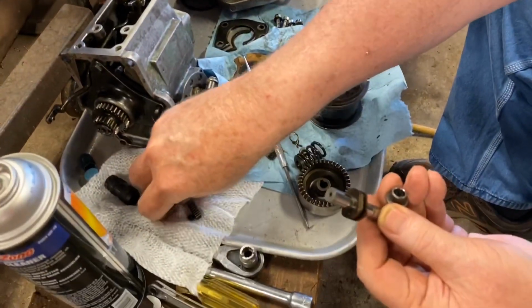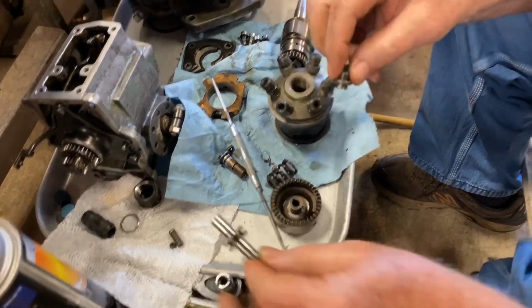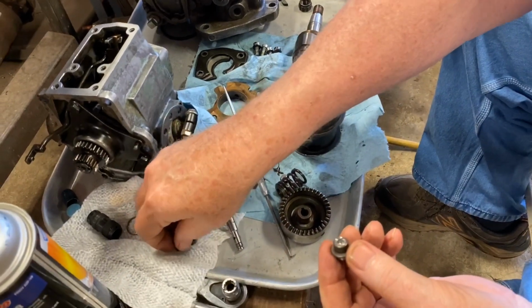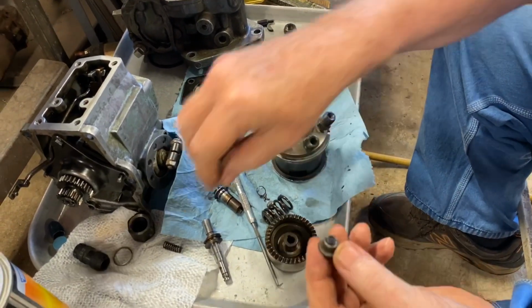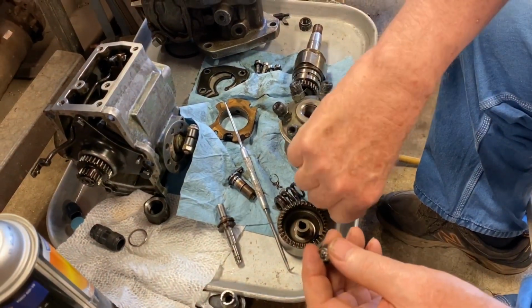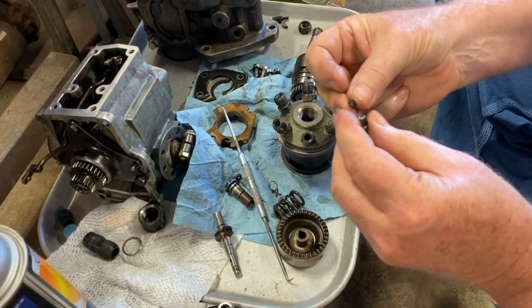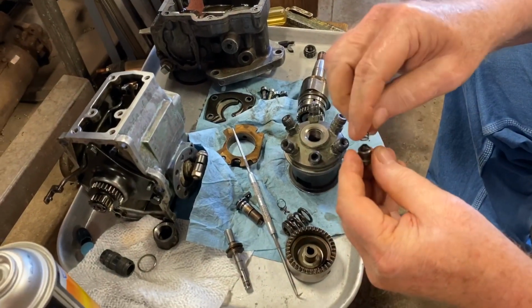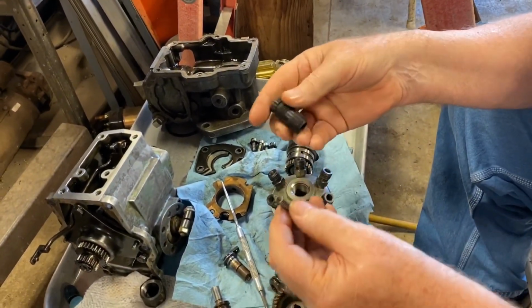And here, this is the delivery valve assembly. It sits up here on top of it. Put this down, get this in here. This little spring guide sits on top of that. And then you got a spring that sits on it. Knocked it out. Get this back on here. Okay, the spring sits on here like this. And all this is sitting in under this, like this.